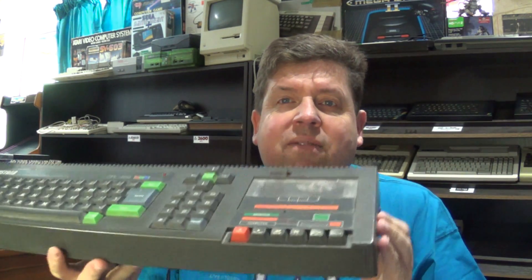So I need another solution and I've got two options. The first option is one of these external tape cassettes — you plug this in, connect it up to another tape deck or to your PC and it plays through the little head and then it reads it on the internal cassette deck. What I don't like about that solution is that you're playing an image from one tape deck to another tape deck, so you've got all that interference in between, and it might lead to a lot of errors when loading.